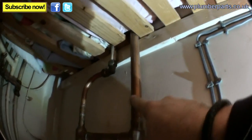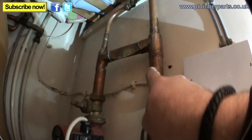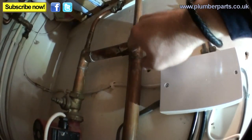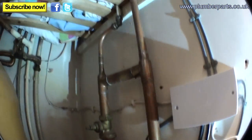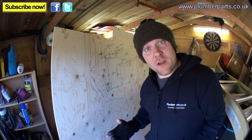The tank we were talking about is basically just above there in the loft above the ceiling. This big pipe is the expansion pipe that went up and over into the tank, and this small pipe is the cold feed pipe that came out of the bottom of the tank. You've got the hot water heating flow coming up from the boiler system being pumped round and back down. When filled, expanding water can get up there and vent itself, and feed water can be sucked down into the system. Whoever was here last popped in an isolator valve on the cold feed from the tank, so to do any work I can just turn that off, turn the heating off, latch open both two-port valves, and drain the system down from the hose downstairs.